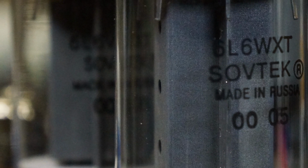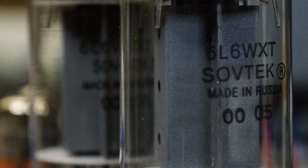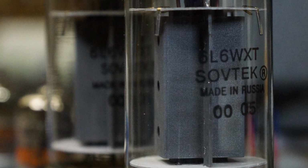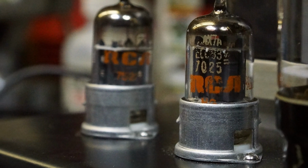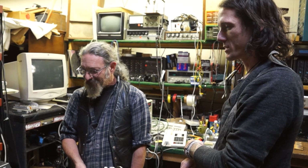The instruction manual says it'll take basically any kind of power tube you want: EL34, 6550, the 6L6 I have in here. You could put in 5881s, so you have a wide range of tone variants based on the output tube you put in there. You know what I hear when we pop that out, I hear the 6550. It has a little bit more present tone than the EL34. Imagine the EL34, something a little softer in this. I couldn't imagine it more dreamy.